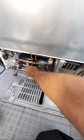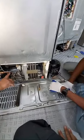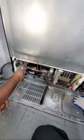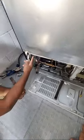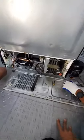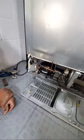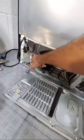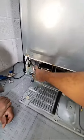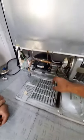So we got this compressor. Okay, so this is the condenser. This would be a discharge, right? Okay, we got a suction or our process, either one. But my thing is, where's the other process line coming from? Let's follow our system. Let's first determine, for whatever theory purpose, this is going to be our process. Here's going to be our suction. That's going to be our discharge.